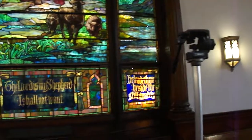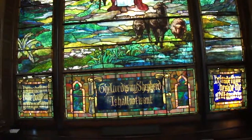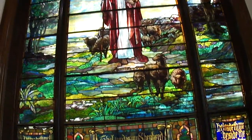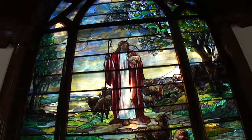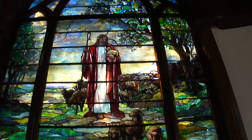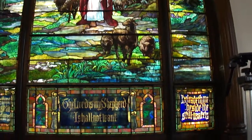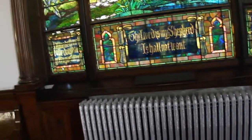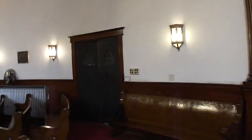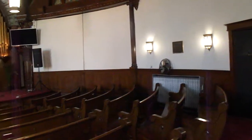Ventilation is very important for this type of building because downstairs there's a very large area in the basement which the church is converting into children's classrooms, and there's no ventilation there. Any other system — mini split or other types of systems — are not going to provide the same efficiency for ventilating as the Unico air handler, because the Unico air handler will support all three: cooling, heating, as well as ventilation.